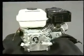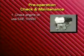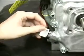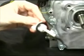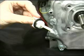The engine. Pre-operation check and maintenance should include, first, checking the engine oil before each use. Engine oil should be detergent, four-stroke SAE 10W-30 for general all-temperature use. The oil level should be filled to the top of the oil filler neck. In extreme temperatures, different viscosities may be needed.